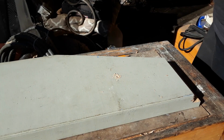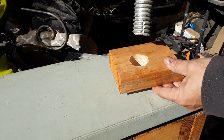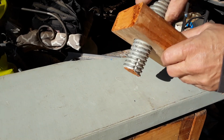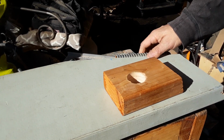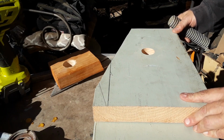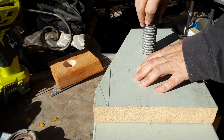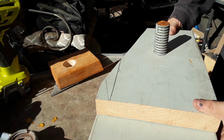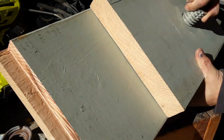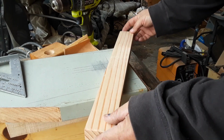There we go. And this is a 1 3/8 hole. This is a cutoff from the old piece that I was testing. And that looks like a good fit, no snags. So that's the hole that I'm going to be drilling through to start with. And it looks like the alignment is off just a tiny bit. There was a bit of wobble in my drill press, but with time and use, that will be eliminated.